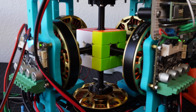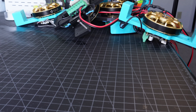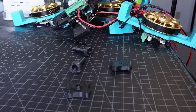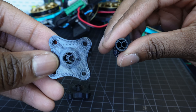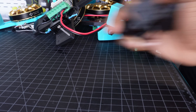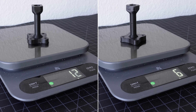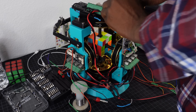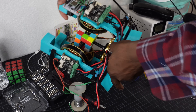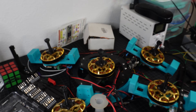The O-Drive boards have a bunch of settings that determine how reactive the motors are. I like to think of the motors as virtual springs that you can dampen or stiffen to your liking using the controller. I started motor testing with one-axis testing, then two-axis testing, then three-axis testing. After a couple of jams, I found out that the motor shafts were pretty weak because a couple of them broke. Printing the shafts at 20% infill made them too hollow to handle the forces due to jamming, so I printed new ones at 100% infill, which doubled the mass and therefore doubled the density. Could I have designed this better? Definitely. Will I redesign it? Definitely not.